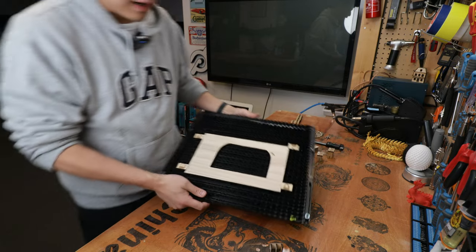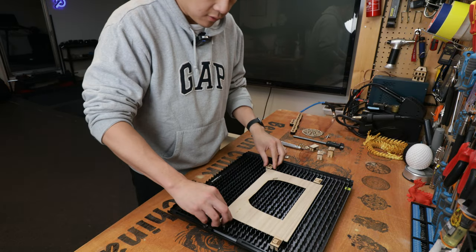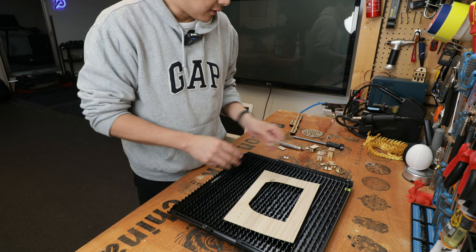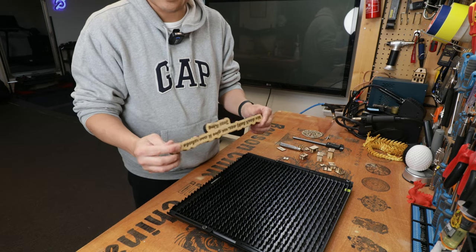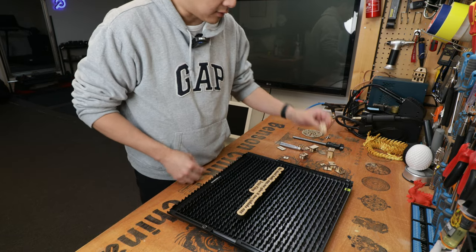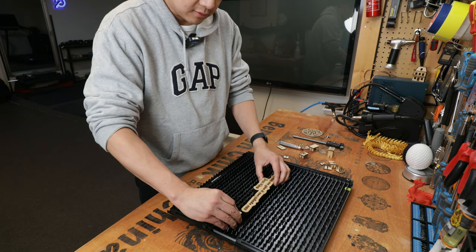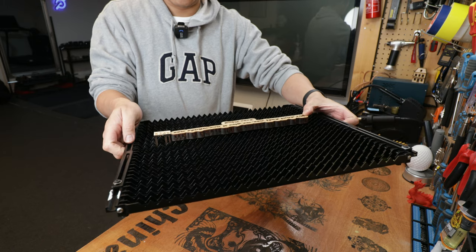If you make a taper shape for the slot it makes it easier to go on. You do have to make a different length of these tabs for different height material — for example if I have a thicker material to cut, I have to cut a longer piece so that when I stick it down I can hold down a piece of thicker material.